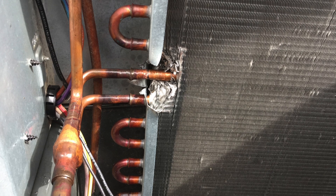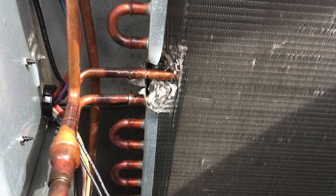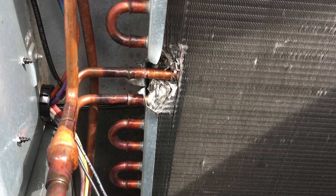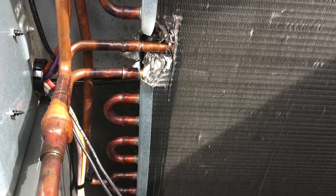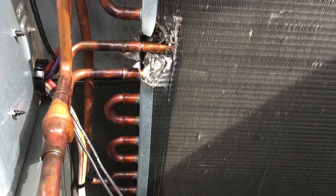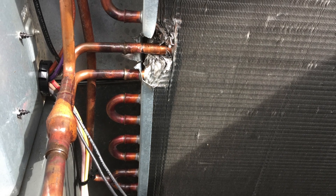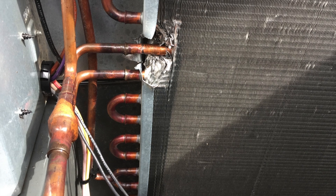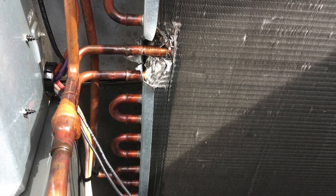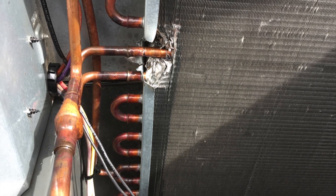That's really kind of silly. You lost about 15 fins on maybe a square inch or two square inches of coil — it's going to make little or no difference. Is this repair viable? Actually it's pretty viable. I've never had one come back on me. All I did on this was braze it over. There's not much to it. This is a viable repair.